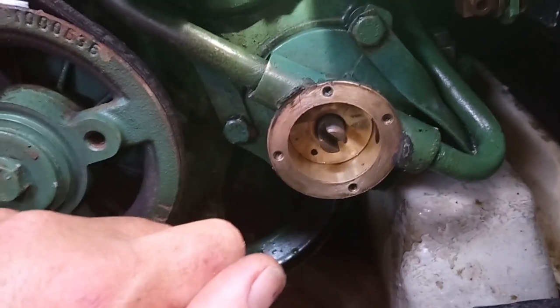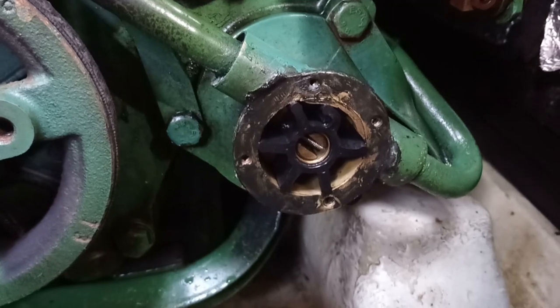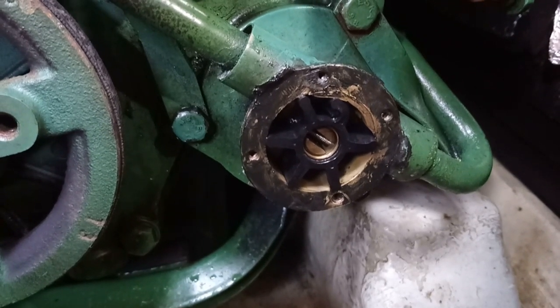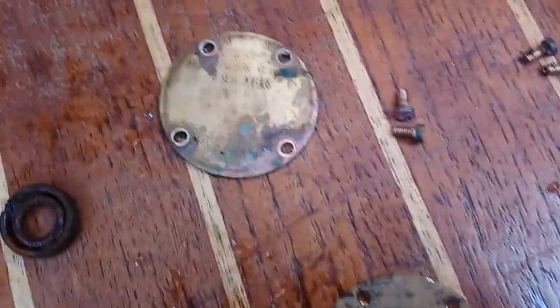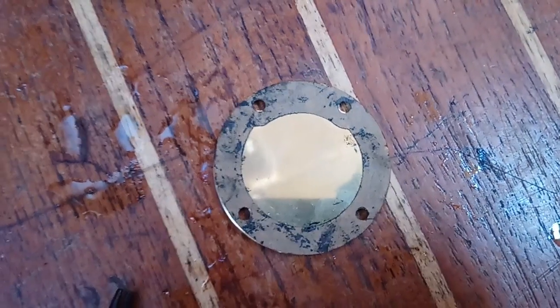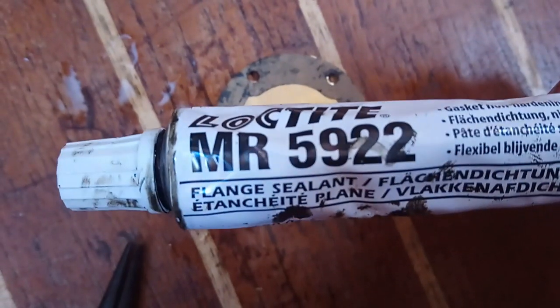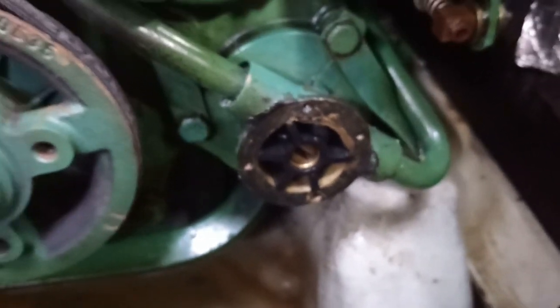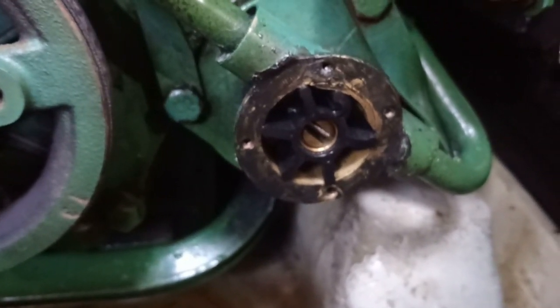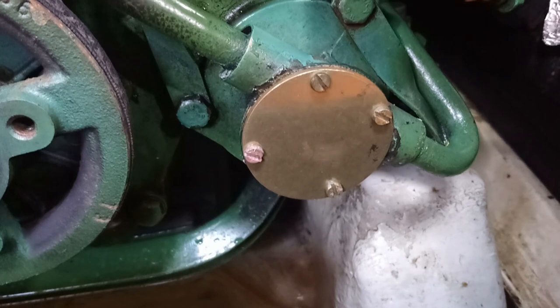I'll give Parts for Engines a call about that. The plate's in, the cam's in, the impeller has been greased and is in. This is the new shiny smooth cover plate with the gasket on, and I've used this flange sealant — I used to use the red stuff but they don't make it anymore. You want to be sparing putting it on; don't put on too much like I tend to do. Now we're ready to put it all together, and then to turn the water back on and test it.